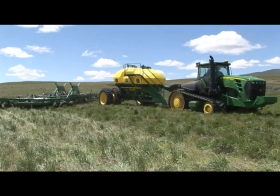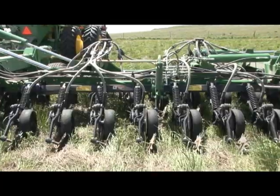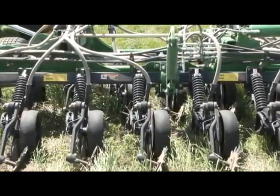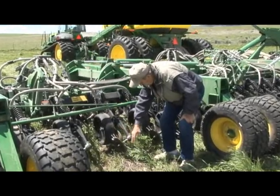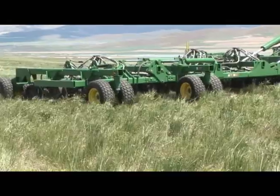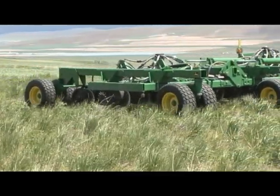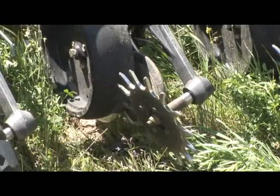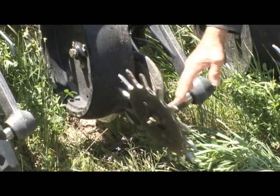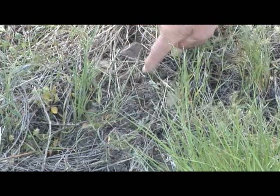It has this feature on it — the opener is about 10 inches apart. You have an option of putting different closing wheels on. You'll see here I've got a spike one. That is very good for moist conditions in seeding in the spring when you have wetter conditions. It goes around and moves the soil back in over the area where the seed has been planted.